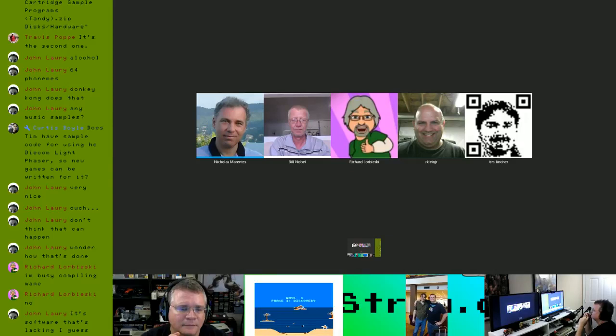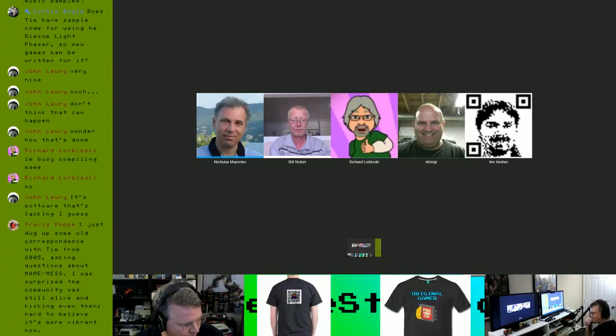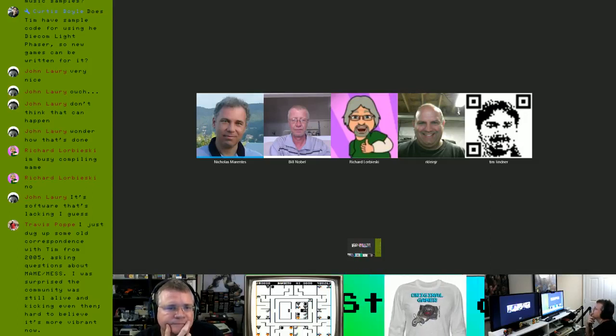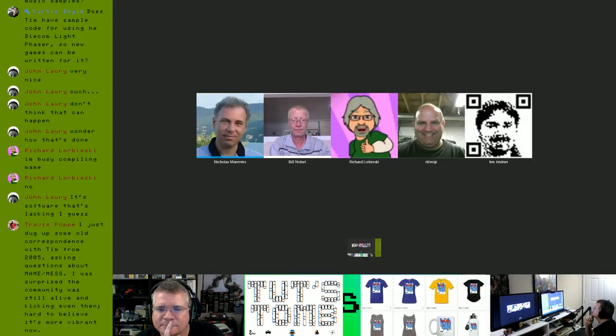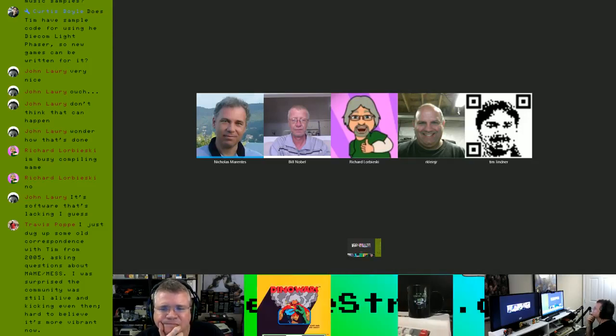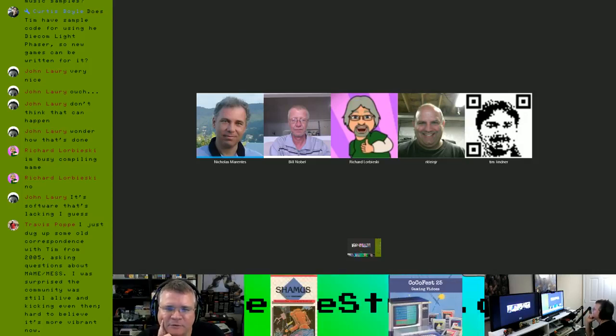Right. Because the fact that you can program a sound effect completely and store it in memory, you don't have to keep coming back within your program to send that data individually. You can just say, okay, play sound 1, and then the onboard microcontroller will send the instructions one by one to the sound chip. That does save a bit of time on the programmer's end. But I think the only unfortunate thing is it doesn't support digital stuff too, if you could send some actual samples to it.